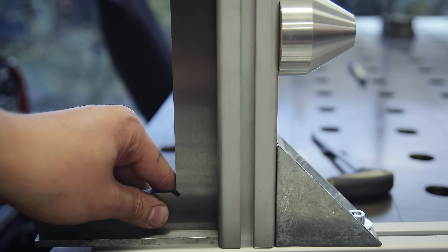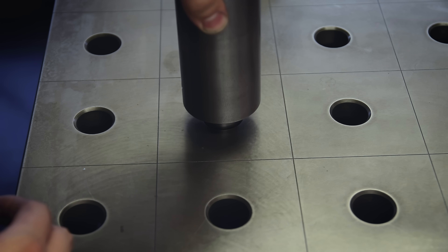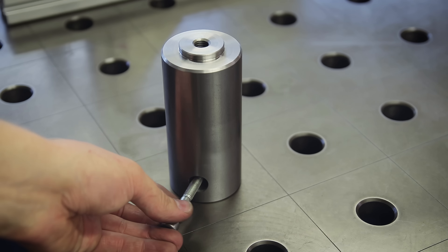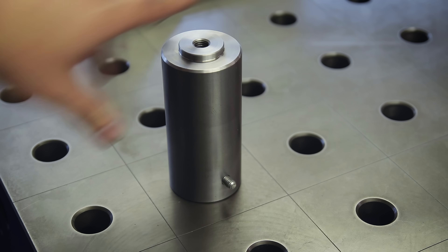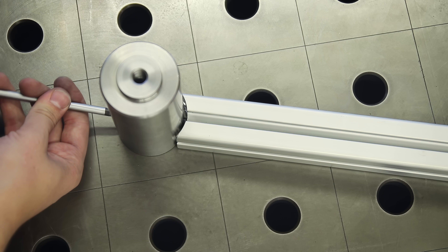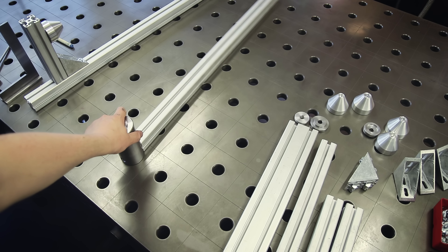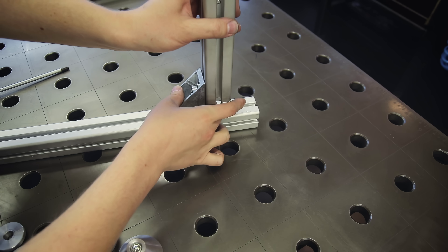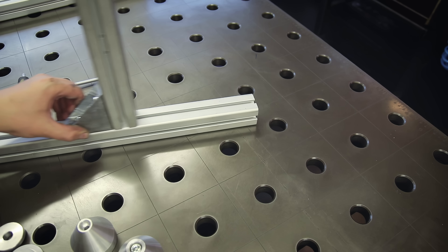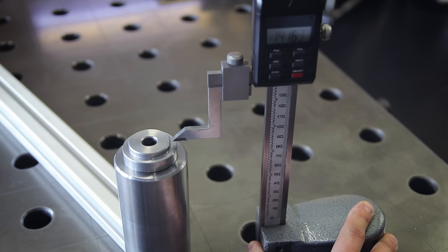The profiles and brackets are usually fairly accurate — unless you're building super high-end road bikes I think this type of setup offers more than enough precision for most things. The post fits nicely into one of the table holes and basically represents the zero point for the entire construction, since most bike builders use the center of the bottom bracket as the main reference point. The long piece of extrusion accepts the seat tube and can be set up at whatever angle you want, so both the bottom bracket position and seat tube angle are determined by this part.